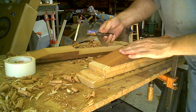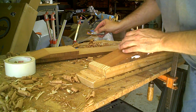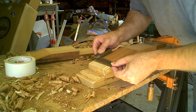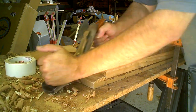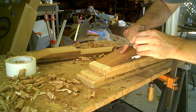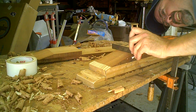I'm going to take my square and make sure these lines are squared up. When they're square, that means I've pretty much got it just right. It's a little off here, so I'm going to focus on that side. Check it again — just a little more. It's starting to look real good here. I also check it this way. I like to see a little bit of a gap down the center, because when I clamp it that'll close up. I don't want gaps in the edges. I've got a little bit of a gap here. There we go — that's looking much better.